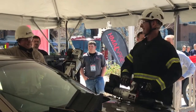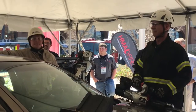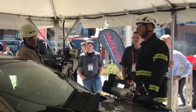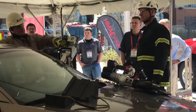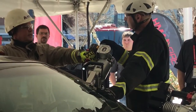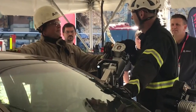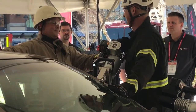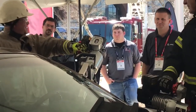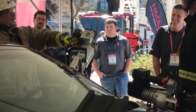We did not just take a DeWalt battery and bolt it onto our stuff. This is all designed and engineered to be an operated match set. The other thing you'll notice with the ION logo on the side, that is the reservoir. We do not use an expandable rubber bladder, which is subject to ripping, tearing, and being punctured. That is an actual metal reservoir with a metal lid on it with a diaphragm inside. So there's virtually no way to expose your hydraulics to atmosphere. The other unique thing is, and it's harder to see, we actually have a test port on this tool.